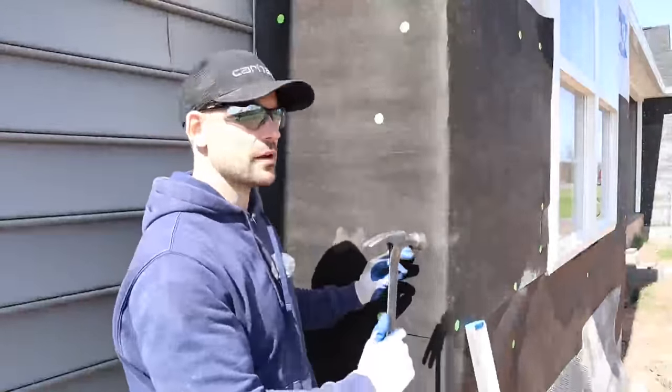You can really go through mortar quickly, and it's really important that you push the mortar into the metal lath so those cups pull the mortar up into it — put a little pressure and really push and slide your trowel. Up around windows, I like to get a little bit of mortar on the end of my trowel and go right up against the window, or finish up against it like this, then take a little extra mortar and push it into the edge of the window and slide up. There are a lot of ways you can do this — do what works best for you.